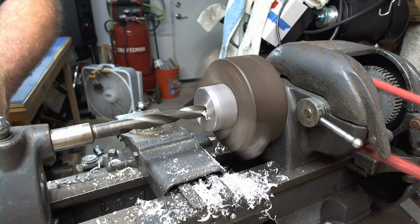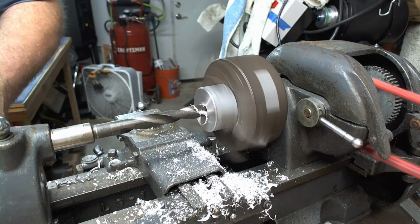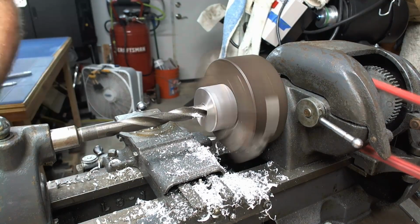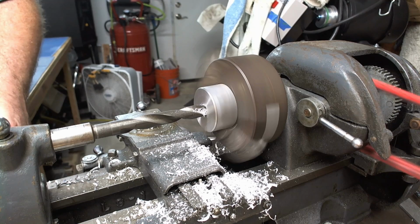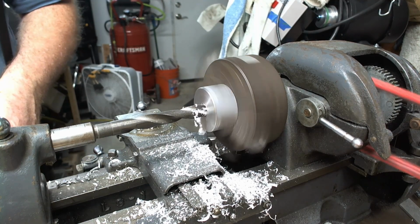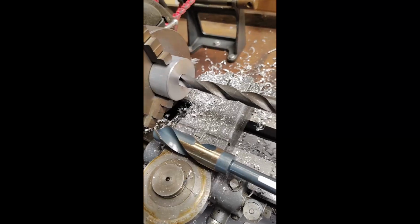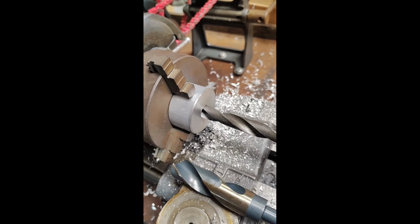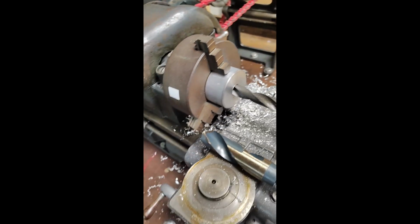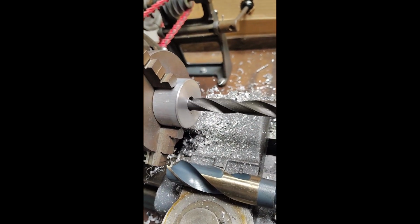So I definitely think the side where they cut off using the cutoff disc, it's one of those fiber discs, I think they must have got it really hot or something, because later, like for this part and the drilling part, it did weird, and later with some of the machining, it did weird. So yeah, very strange. Well, I managed to get it with the smaller bit, which is 9/32, and I managed to get it with this larger bit, which is 17/32, but I didn't manage to get it the whole way through because it's taking a super long time.